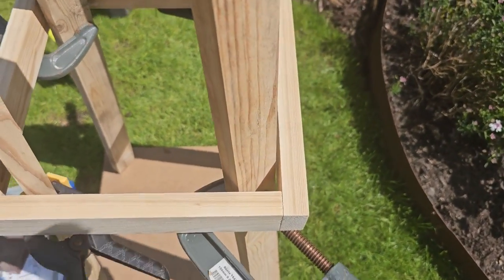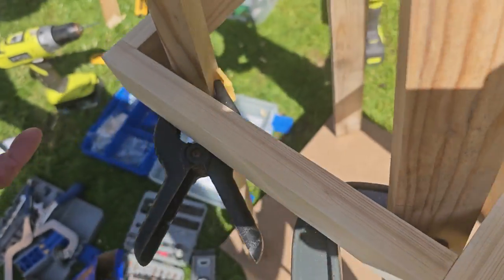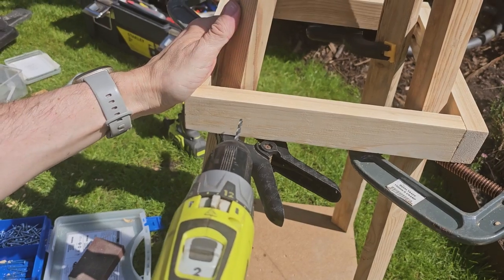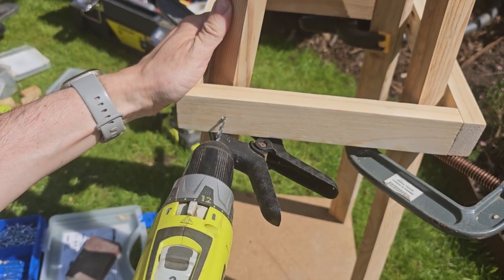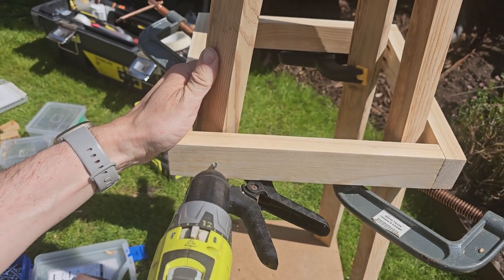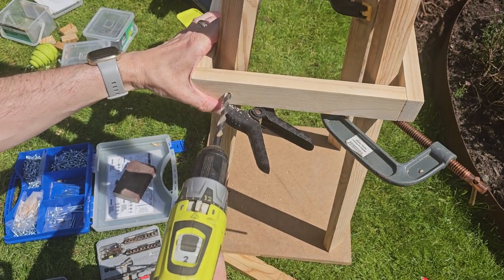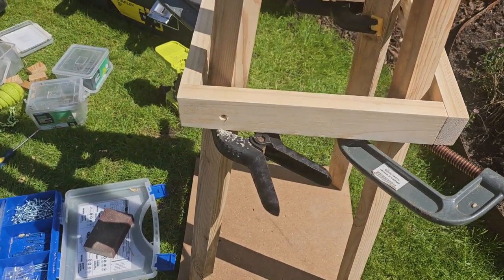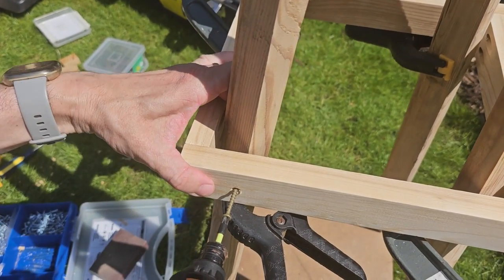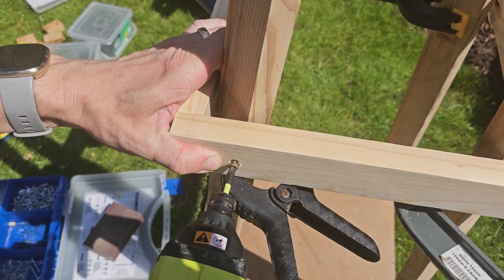You want to go in from this angle here. We designed it so they weren't flat against the main struts — just placed in like this. You screw straight through this little frame into the other one and add in your little screw. This is the countersinking of the screw head — just a little bit bigger with a larger drill bit. Then you're ready to do the actual screws directly into the frame.